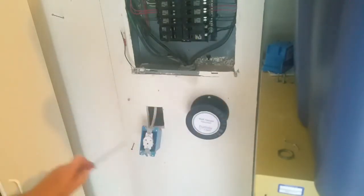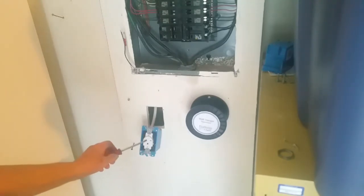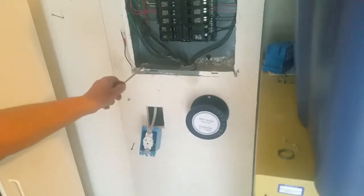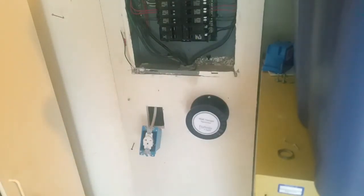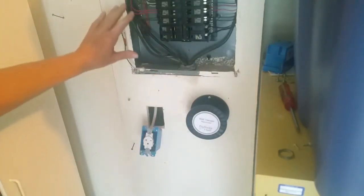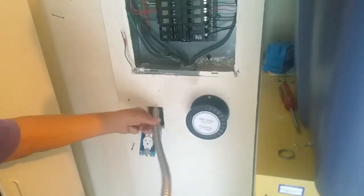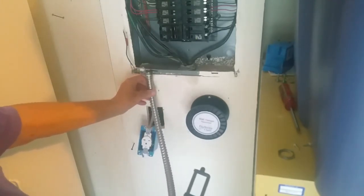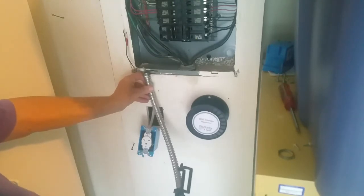You're going to mark the four corners of your box — you can trace your box there. You can pre-assemble your box with the wires in the back, wired up to the standard plug. Feed the wires up through the wall, and don't forget to put the nut on the wires. Once you get the cable clamp through the hole, you're going to screw the nut on the cable clamp and drive it tight on the edge with a screwdriver and a hammer. In case your box is not conveniently located next to your breaker box, you can take a piece of either flexible or rigid conduit, drill a hole in the wall, feed the conduit up into the knockout in the breaker box, and run that cable to wherever you need to go with your 6-20 plug.